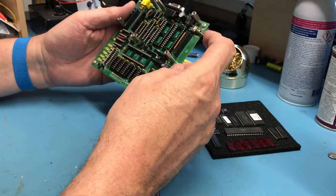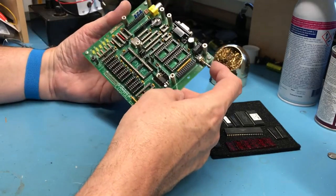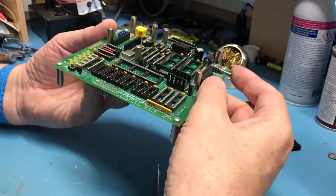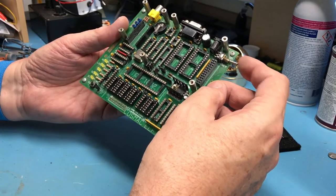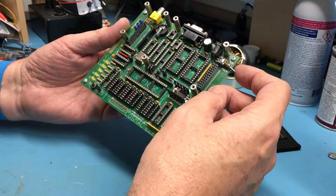So we're down to the core of the board. I really can see that I kludged in a power switch here. It's the right width, but it doesn't have 90 degree bent pins, and I've got little jumper wires in there and a really lousy little strap over the top soldered in place. I will look for an appropriate replacement and do a better job of that switch.